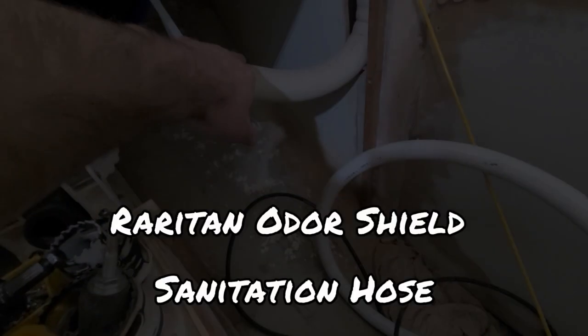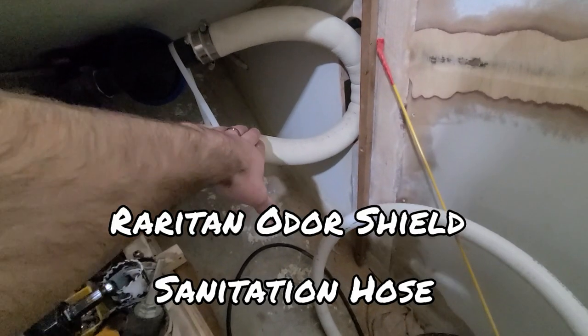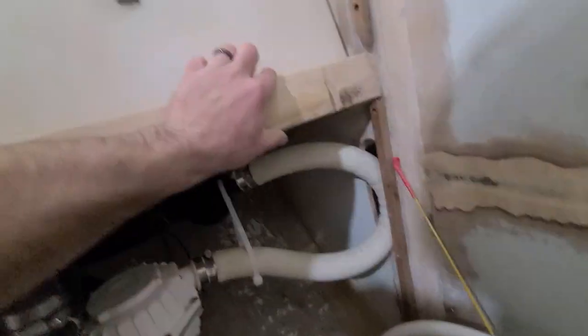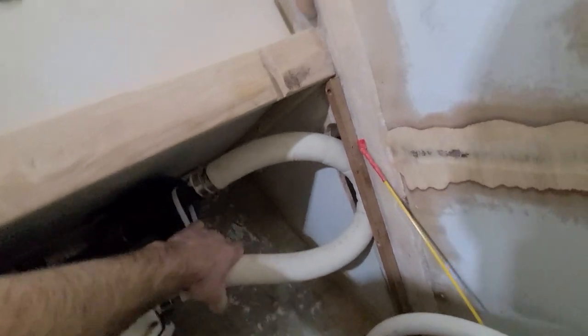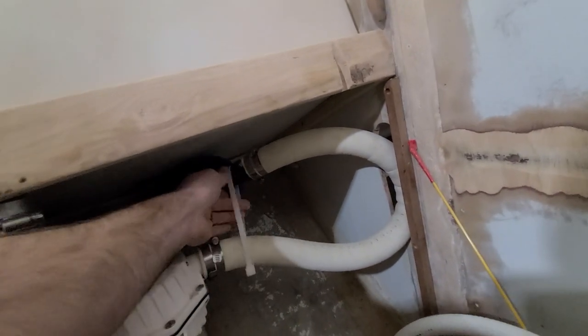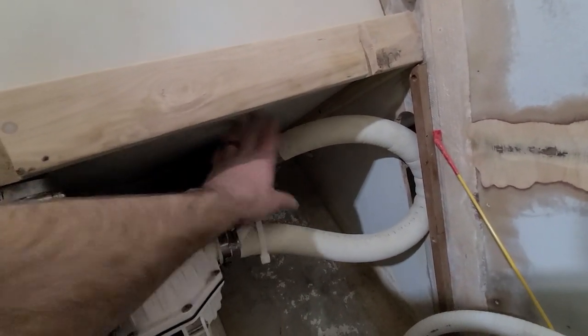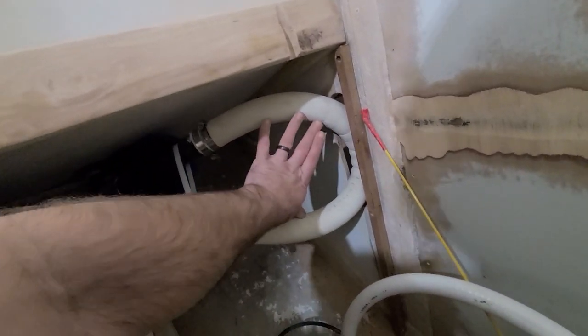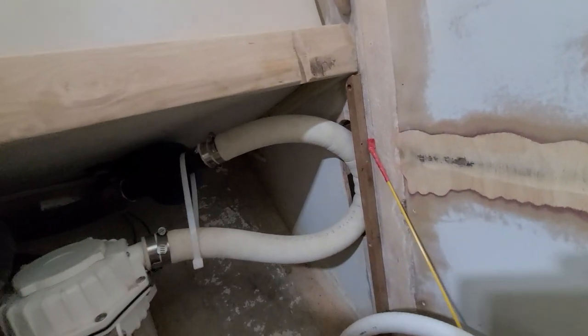We can always stick the handle in and manually pump it too. I'm actually pretty excited about it. The only thing I'm really worried about is I have a very flexible white hose. This is made to have a curve radius of slightly less than this, believe it or not. With this radius being okay, I just wanted to give it a little support, but there's no tension on this — this is the natural radius of the hose, and it's within the six inches that you're allowed to have.